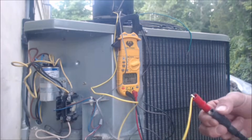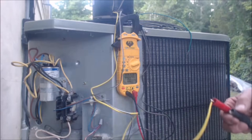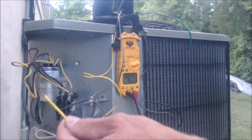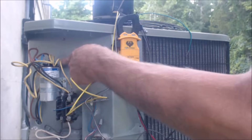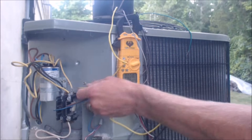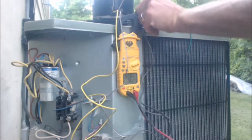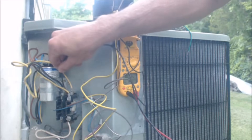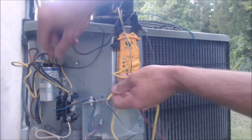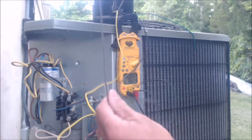What you're going to do is cut off the brown/white wire, wire-nut it, and make sure the wire nut is inside the electrical cabinet. As for the yellow wire, it can either be connected onto the common terminal of the existing capacitor — it'll say C on it, and you'll see the other yellow wires coming off of it — or it can be connected right to the contactor. That's 120 volts going in, and then the black wire goes to the other 120-volt leg — 240 volts total.